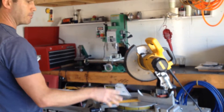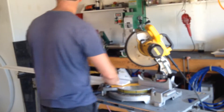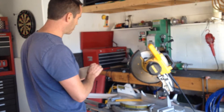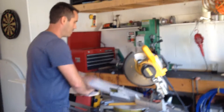Right here I have a full table with rollers set up. Not everyone has a full table like this — your do-it-yourselfers or your small contractor. Rollers do come in handy as far as the piece sliding. But in an instance like this, you've got a piece of wood that's not perfectly straight, which is pretty common. It doesn't always engage the roller, so it's tough to slide on the base itself.